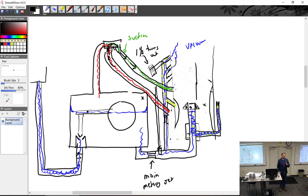Where you set the mixture is going to affect the idle. So say I do idle speed first. You spend 20 minutes getting that idle speed just perfect. You get in, oh man, it's 1,000. Okay, I'm going to get out, shut everything down, back it out a bit, start it again. Okay, 900, we're getting close. Three or four times, you finally get it. Now it's too low, now it's too high. You're taking an hour to set the idle speed. Oh man, it's right there, 550. Now let's set the idle mixture. And I pull it back and I have a 200 RPM rise. It's way too rich, so now you have to start messing with that.